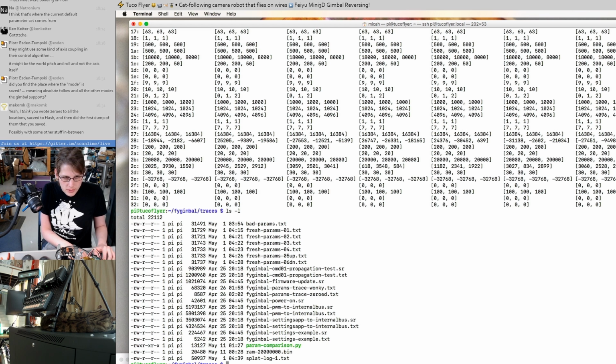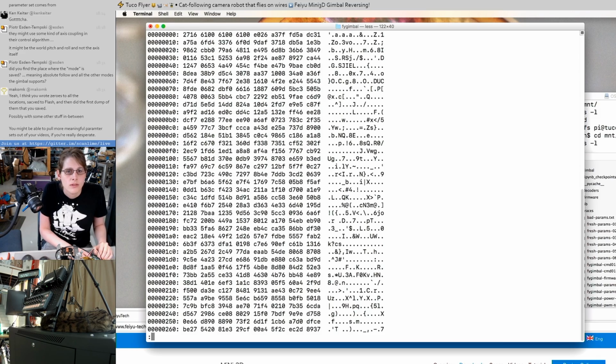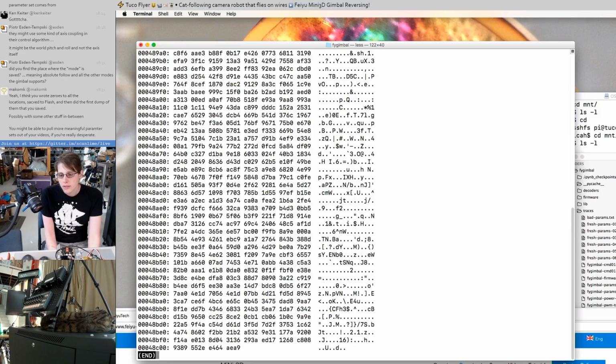Anyway, maybe this is a good time to take a look at the firmware. If you look at the .bin, it looks pretty encrypted. The flash readout protection was set up, so we couldn't just read out the decrypted firmware. But I made a RAM dump.